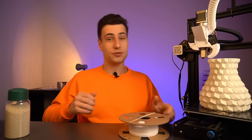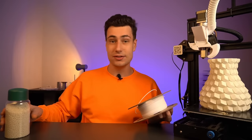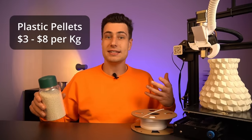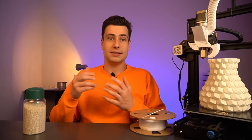This is my custom-built 3D Pellet Extruder printhead and instead of printing with regular filament, it prints directly with the raw material filament is made out of — plastic pellets. These cost 5 to 10 times less despite being the same plastic, and you can also 3D print with sugar and chocolate, or basically anything as long as it is in granulated form and can melt.